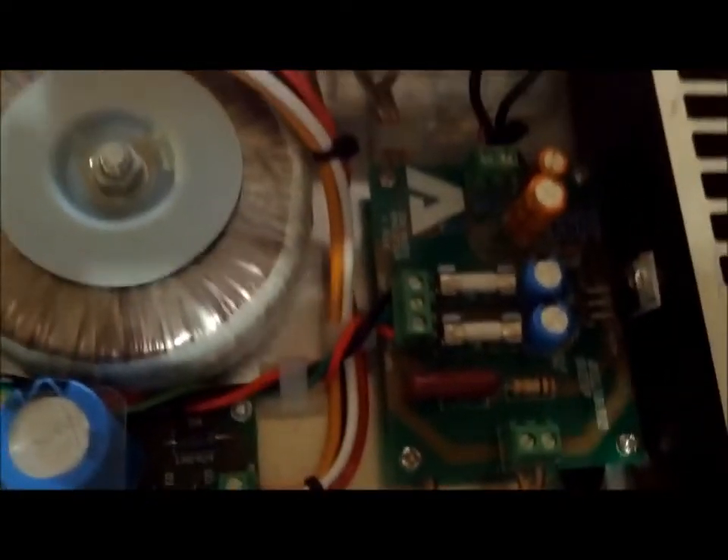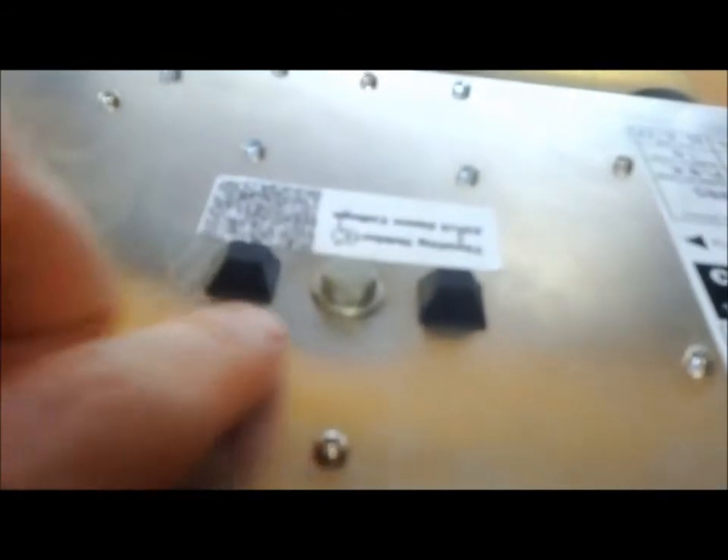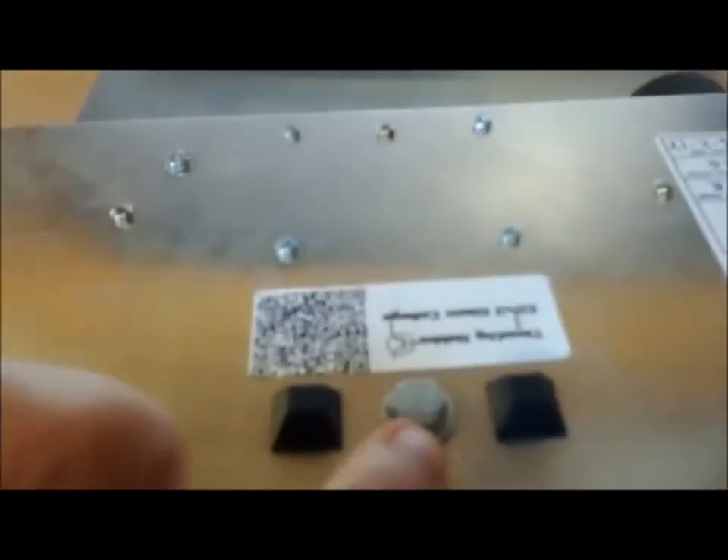Diodes — sort of a bridge rectifier. It does have an electrical safety approval sticker on the bottom, because it had to, to be allowed to use here. It's got my name on it. You'll see there's a dent where I tightened down that bolt. If I did it again, I'd put a metal plate on the inside underneath there — like a 2mm metal plate — and also use a bigger washer on the outside. I did put additional feet on there, because that's where most of the weight is, so the weight of the transformer sits on those feet rather than stressing the bottom of the case and the boards.